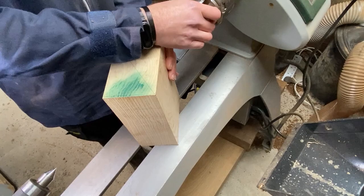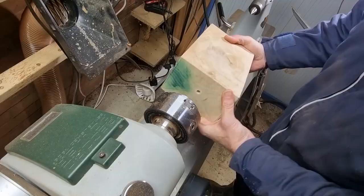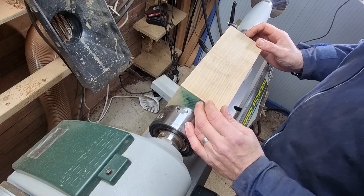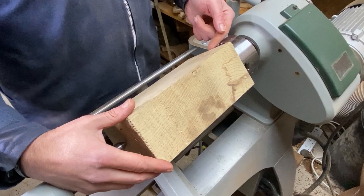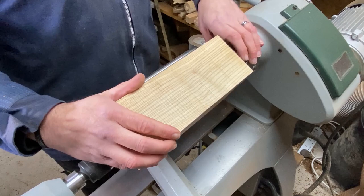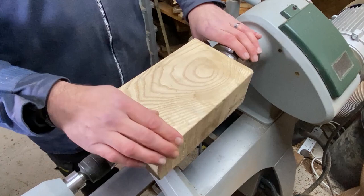So this is the flattest end so we're going to put our screw hole in there and then mount it onto the worm screw. Because the way we've got it mounted, we've got a worm screw this end and a tailstock this end — at the moment it is perfectly safe. If we were to take the tailstock out, it's going to put a lot of extra forces on the worm screw and as the worm screw is only held into end grain there is a chance that it's going to work loose. So depending on how it's going I may choose an internal recess and change that to an external tenon.